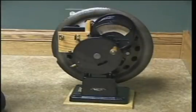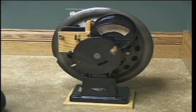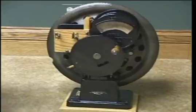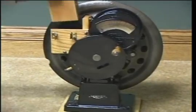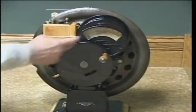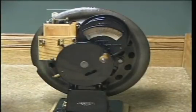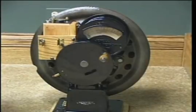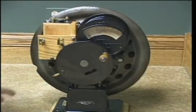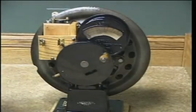This is an Allen hand-cranked coil tester, typical of the Model T era — this one's fully restored with magnets remagnetized. This is what I've been using to set up Fun Projects ignition coils for these tests. I'll now plug a coil in — the same coil I just had in the strobo spark — and hopefully it should produce 16 and only 16 sparks, one for each pulse of the magneto, with the operate current coming up to mid-range or 1.3 amps. This tester does not use the usual drum; it has a rotatable spark gap and the sparks actually stand in mid-air.